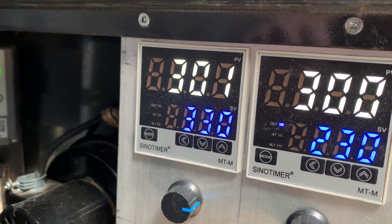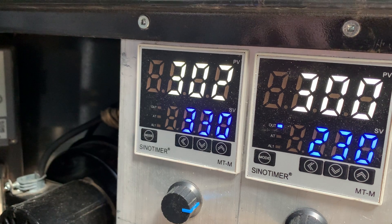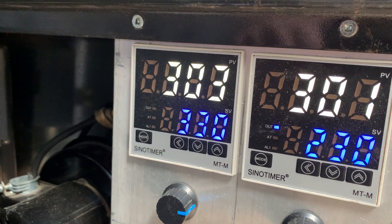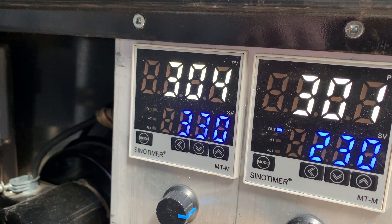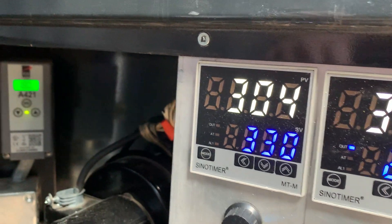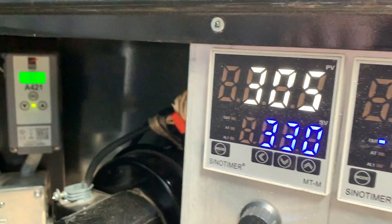What we're doing is basically slowing the fire down so that it keeps the flue hot enough, but it's not sending so much heat up the chimney — therefore heating the water quicker. We're at 180 and climbing up fairly quickly.